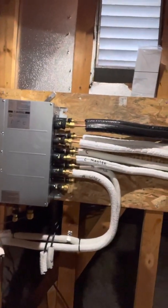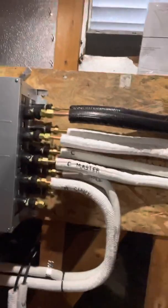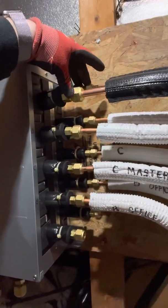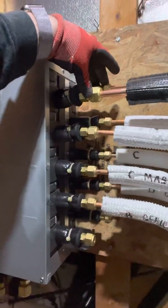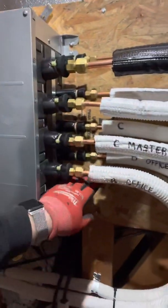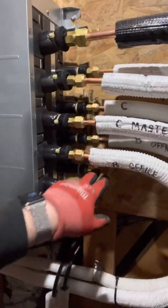I'm up here in an attic right now and I'm going to show you what we've been doing up here. We're doing a branch box install — we just started this one today and we ran basically four sets of refrigerant lines. If you look at the branch box, you'll notice that this one here is bigger, and it's always going to be bigger. This is for units bigger than one ton — you're going to put your 18s on here. We're only going to be doing four, so this port here, the A port, is not going to be used. Just remember when you're doing your addressing inside here, make sure you address that you're not using the A circuit — just B through D.